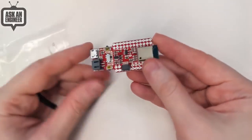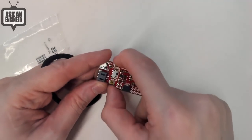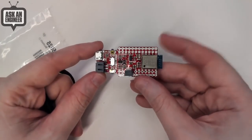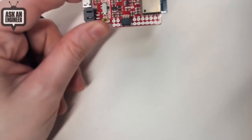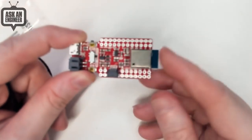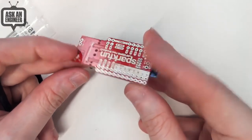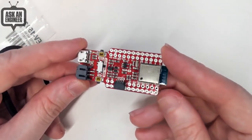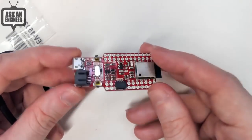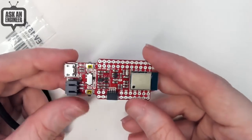So it's got the NRF52840 module, a quick connector, on-off switch, reset button and a user button, battery and USB. And of course the NRF52840, what's really nice about this chipset from Nordic is not only does it do Bluetooth low energy, but it also has built-in native USB. So very exciting. We have an Arduino core and some CircuitPython development that is happening. So check it out, especially if you're getting one of these boards, you can load CircuitPython on it and try it out. We're getting there. We've got the peripherals going, Bluetooth is coming along.